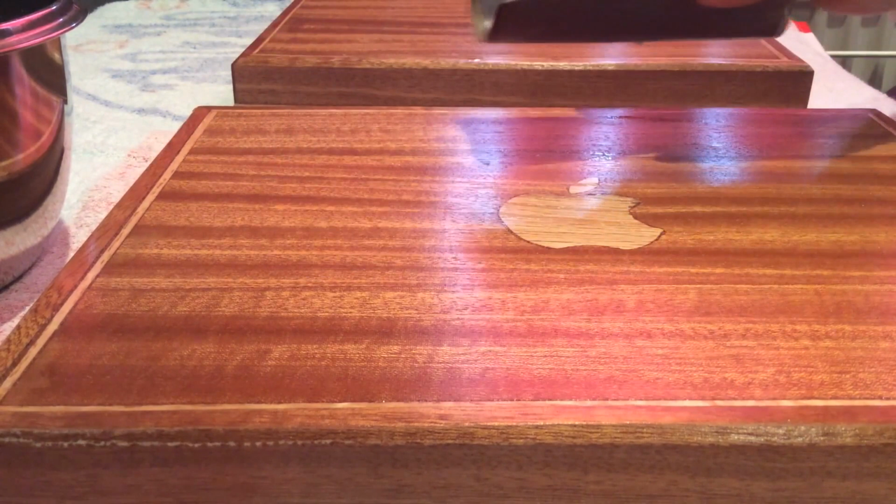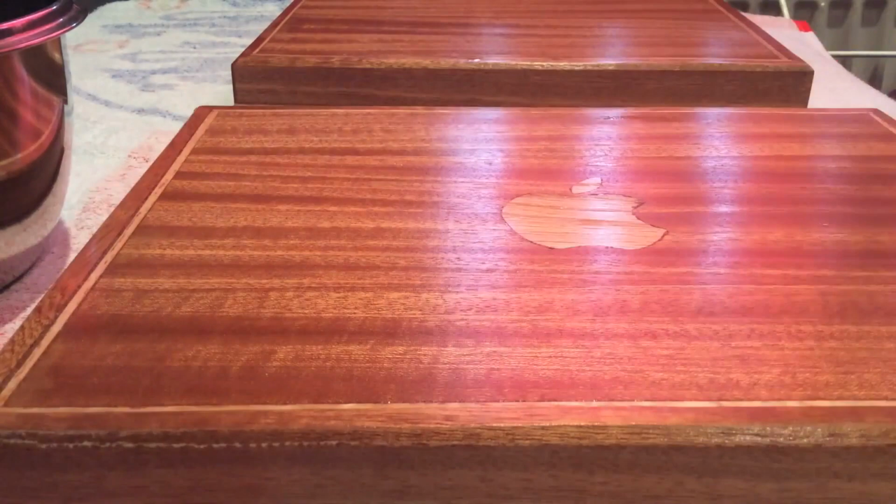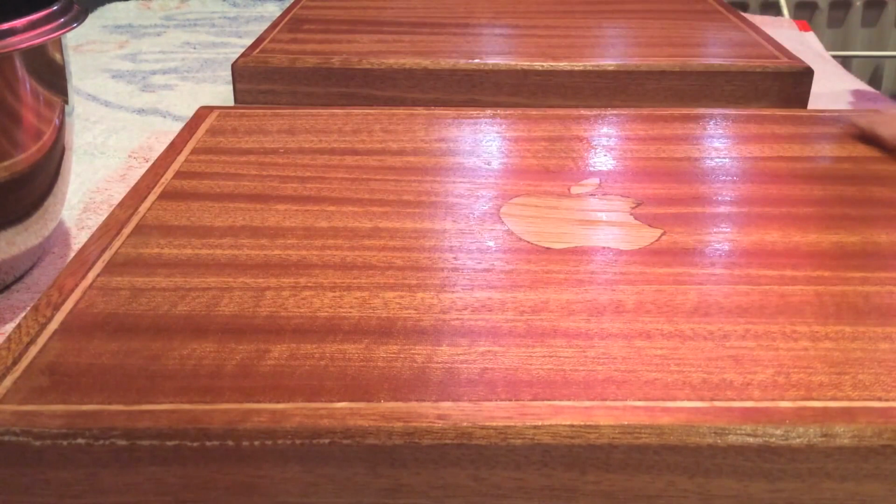One thing I will say, you haven't got to go with the grain, because remember you're only actually sanding the finish on top, but when you decide which direction you're going to go in, it's best to keep with that direction all the way through. That's literally all it should take. That feels smooth to the touch in there. I can't feel any raised sections, so I'll just dry that off with a piece of rag.